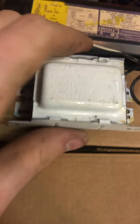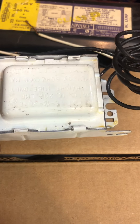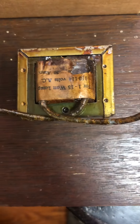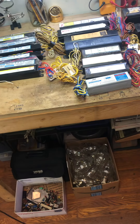I have a bunch of these preheat chokes that can range from an F8 T5 all the way up to a 20 watt fluorescent lamp — you can see I have a bunch of them here in stock. I have this one here which is for a 15 watt manual preheat circuit. So that's just about all of them that are unused, not counting all the ones I have in my fixtures — I probably wouldn't have enough room in here if I demonstrated all those.